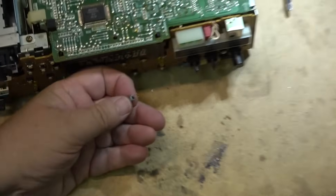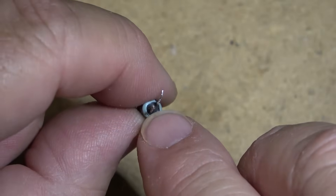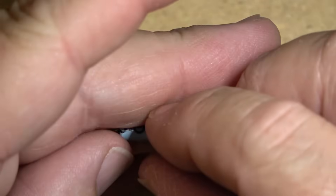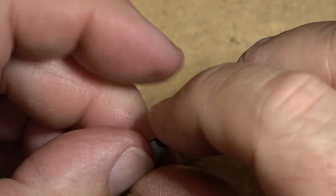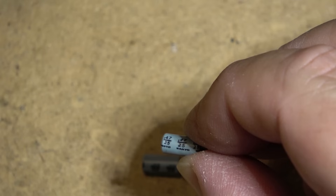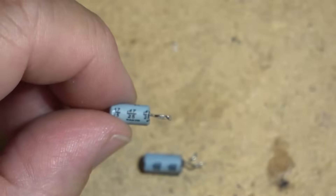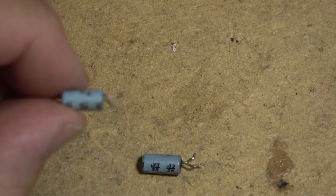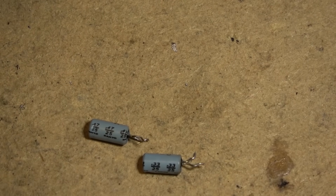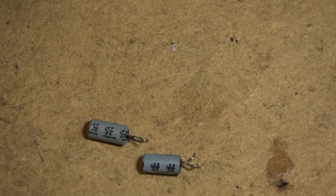These were what we had to change on all of those SL-5000 series — 5000, 5010, 5020, 5200 — all of the original large front-loaders with the 710 chassis. We had to pull the servo board and we had a template that fit over all the caps that had to be changed — like 47 of them that had to be changed out. At least this one only had two. Anyway, I think that pretty much does it, so let's throw this one back together.